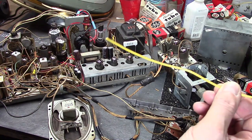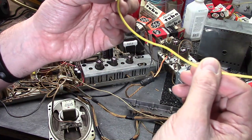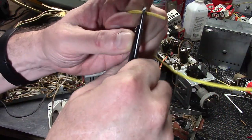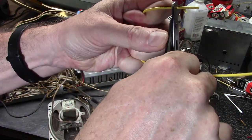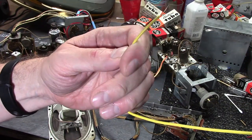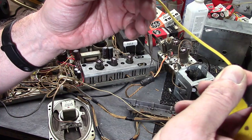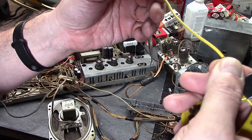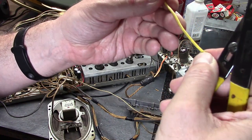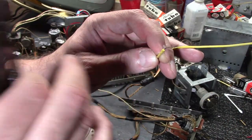I recently bought a bunch of spools from DigiKey, probably made by Alpha - one of the more well-known wire suppliers. Rather than being two layers, it's single layer PVC plastic insulation with exactly the same type of wire inside: tin-plated copper. It's rated for 105 degrees Celsius, 600 volts, and it's 22 AWG. I might have said 24 earlier, but 22 is what most of the wiring is.